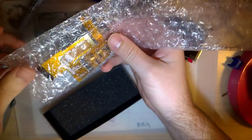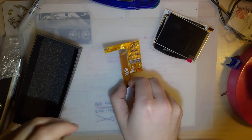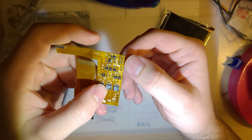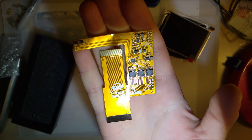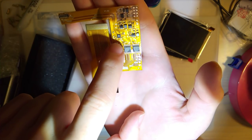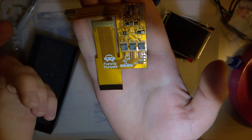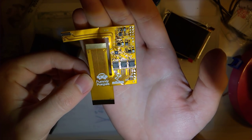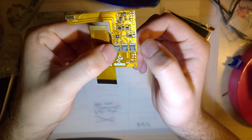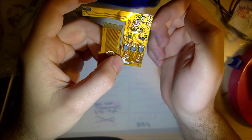Last but certainly not least, here is the ribbon adapter itself. This ribbon is where all the magic happens. There's nothing on the back - all the electronics are on the front. There are some test pads here. There's an itty bitty little chip here that looks like it's doing the magic, and three other chips - Benven suggested they might be level shifters, though his latest post indicates that might not be what they are. All the identifying markings are etched off on the main chips.